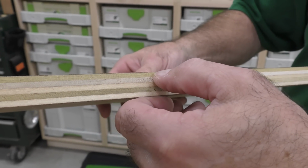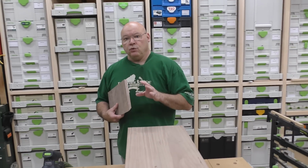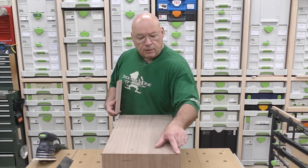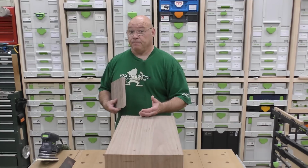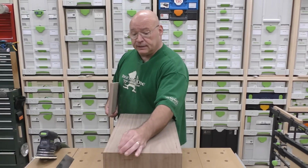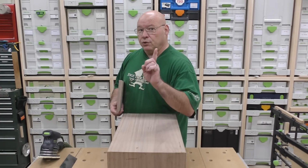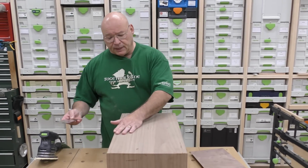And what I'm gonna talk about now is you have to do your due diligence to remove all your witness marks, all your writing, but also making sure your glue residue is completely out of there before you put your finish on. You have to be very careful because that is really thin veneer and you can burn through it really quick. So you have to do your due diligence. So there's a few things I do first when I break something out of the clamps.